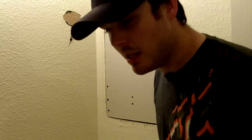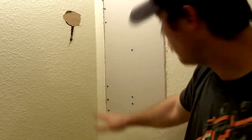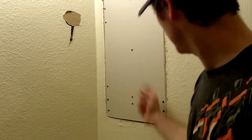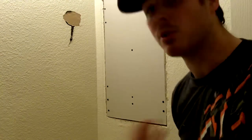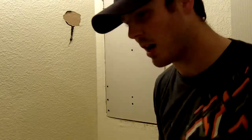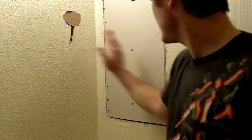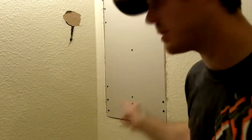I'm sorry this video got long, but I had to make an adjustment. Normally you should have flanges around the outside — that way you have something to screw into and not just the middle piece. That's something I totally forgot about. So if you can, use another two-foot piece going to each edge so you can actually screw into it and you won't have this problem at all. As of right now it looks like our time is up. Hope you enjoyed this episode — leave a comment below and I will see you guys next time. Peace!